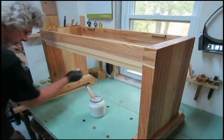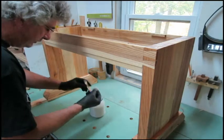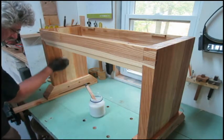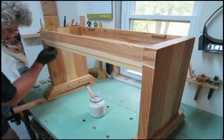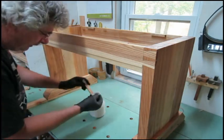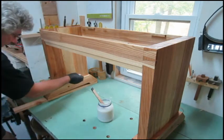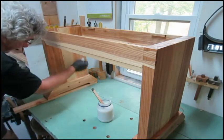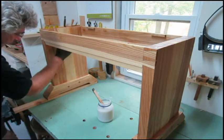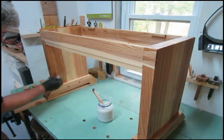I always like several thin coats better than thick coats. You can feel it — you get a little bit of a layer on there that really lets the pad, your cloth, rag, whatever, really glide over the surface nicely.